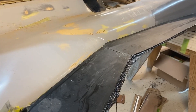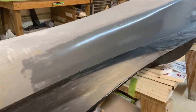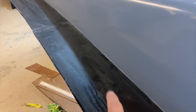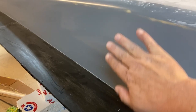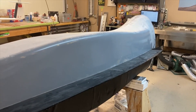The bottom side boards are all off and just semi-cleaned — I haven't really done anything yet except pop them off and get rid of the loose stuff. But look at that nice perfect seam line. This side's going to go pretty quick, especially since I don't have to make any splitters for this side because this half of the mold becomes the new flange. So I'll wax and PVA this and then start with gel coat and carbon for the other half of the mold. We should be done making molds here real soon — I've been making molds for a couple of years so I'm kind of over that.